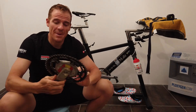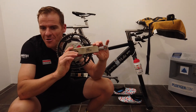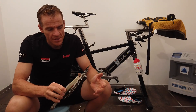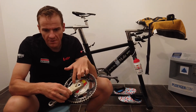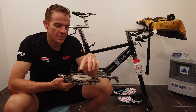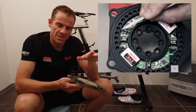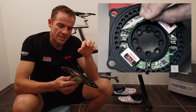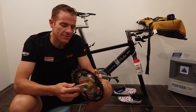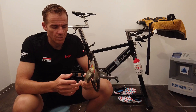This video is going to be about what is a power meter. What are they and how does it work? How a power meter works is if you were to take off the plastic parts you would see the spider would extend, and on the spider there would be strain gauges - sensors attached to the metal that measure the amount of flex in the crank, and that amount of flex gets calculated into watts.